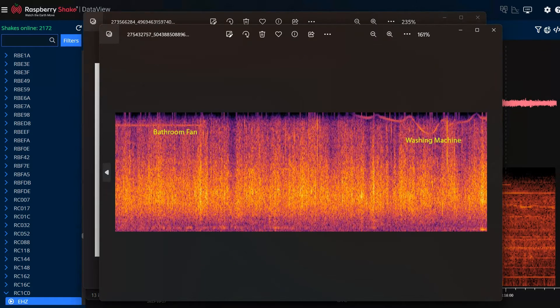You can see how noisy it gets during the height of the daytime — these are all vehicles driving by on that road. Luckily they don't put a lot of energy in that 0 to 10 hertz range, so earthquakes still show up even during daytime hours. This signal here is my bathroom fan running, then I turned it off. And this signal is my washing machine going through different spin cycles. You pick up all kinds of stuff on here that you wouldn't think you would.